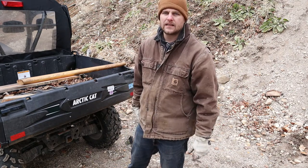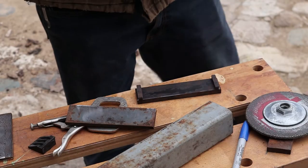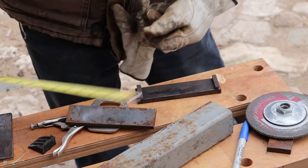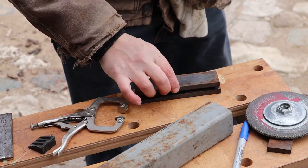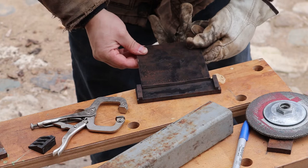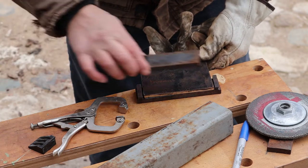Here's the build process. What I've got here is a six-inch long piece of inch-and-a-half wide tubing and two little quarter-inch by quarter-inch pieces that are inch-and-a-half long. I'm going to sandwich them together. This plate here in my hand is approximately five by five — I found it in my scrap pile — and it's going to be the male part that slides in.